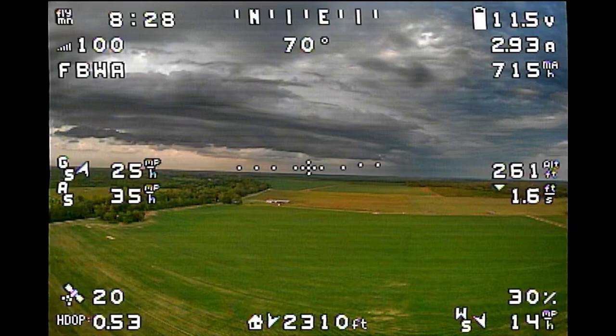Down low, fighting the gusty wind, I'm seeing a little bit of oscillation again mostly in the pitch axis. I may revisit that and lower the P gain a bit more, but I want to fly it first in better, less gusty conditions to see how it feels. I also noticed a little slop in the control linkages — the weird snap-on ball links have slop where the Z-bends fit in the servo arms. I'm planning to replace those with proper bolted-in M2 ball ends and a slightly larger-diameter linkage.